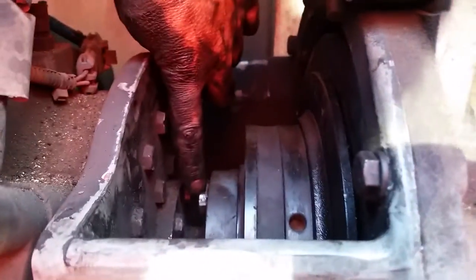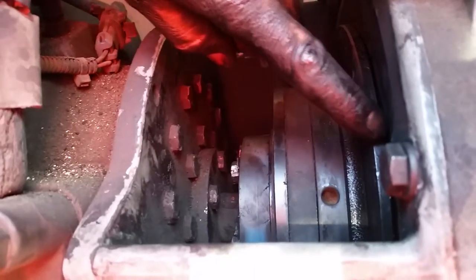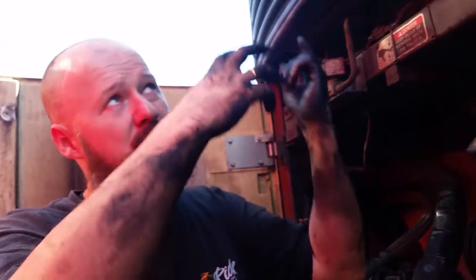You make sure that these bolts align between these two on the compressor. So when you push this that way, you have enough room to slide a belt between here, and then you do it. Other belts have the pulleys, pulley tensioners, that you undo and you just pull the belts over the fan or alternator. It's easy to replace.